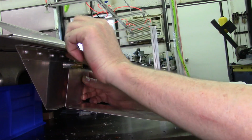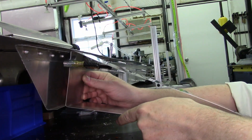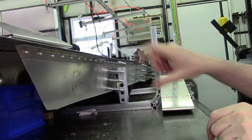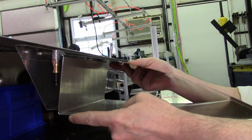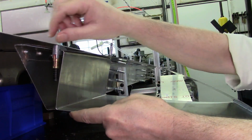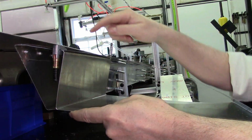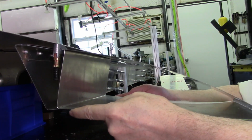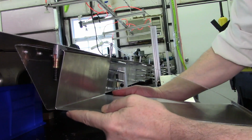Now this wing skin here, the reason this is under the wing skin a little bit is because I haven't done the final trimming on this yet. But at this point, that looks good. And the rear channel is constant width all the way across. So just checking the aileron now to see what we've got. Try and get this somewhat lined up on the top. The aileron skin is just slightly longer than the rear channel. I haven't trimmed it back yet, but just to try and get an idea of what things should look like, it's looking pretty good.